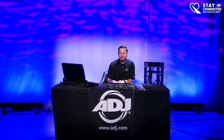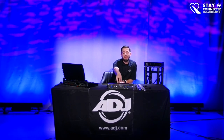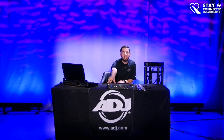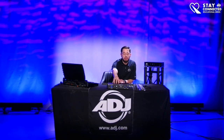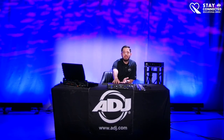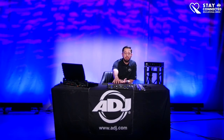Oh, I'm sorry. The last thing that I didn't fully go into was I mentioned that directly from the computer, you're able to run 5 of these linked within one another. So obviously 1 plus 4 more is going to give you 5. In the event that you needed more than that, you would just have to input a network gigabit switch. Obviously, the max on that is going to be 10 outputs, which will then allow you to do 5 units per output, which is going to give you a max of 50 pixel drivers out of 1.